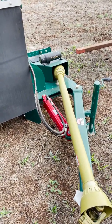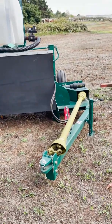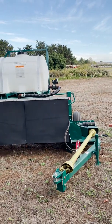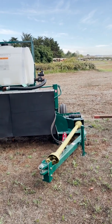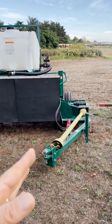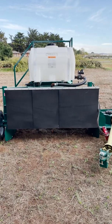The red cylinder there is the hydraulic ram, and those two black lines connect to the tractor. When we're on the back of the tractor and we engage it, we can extend that hydraulic ram so that it gets longer and longer. When we do that, the whole compost turner, as we're driving, will actually shift to the left. Right now that tire would track right behind the tractor, but when we extend that hydraulic ram, the green tow bar will actually move that direction, and the whole compost turner will shift to the left so you can essentially drive right next to a pile with the tractor and this turner will go over it.